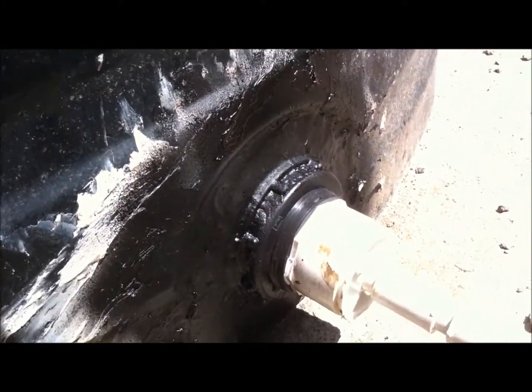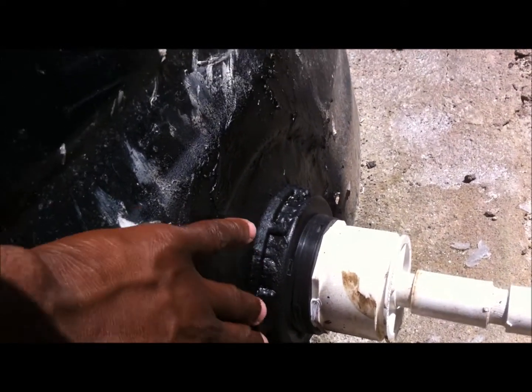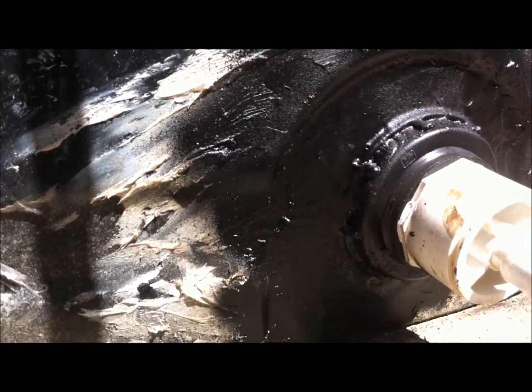So after doing the repair, I realized that it is still leaking. What happened is that the water tank, right where the bulkhead allows the water to come out and go into the main line for either domestic purposes or for my fish keeping hobby, had a little split there. The split led from where the bulkhead hole is, upward about half an inch. After placing the bulkhead on, I did not see the split. After screwing it on and everything, water still kept coming out.